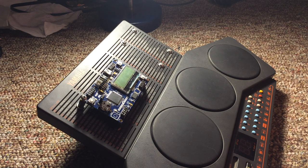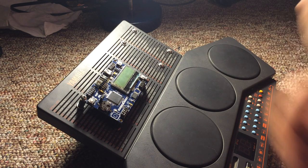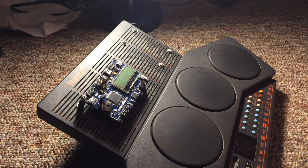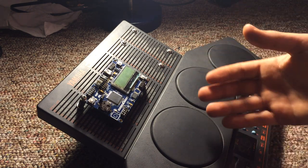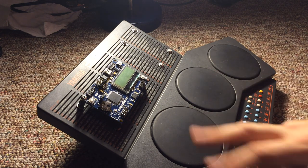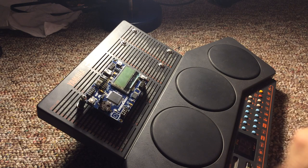The only thing is it's a little harder to program. You can't just program it over USB like an Arduino because it doesn't have a built-in bootloader, unless I made one. You program it with either a JTAG or PDI programmer provided by Atmel, or you could build your own. Lady Ada has a tutorial on how to do that.